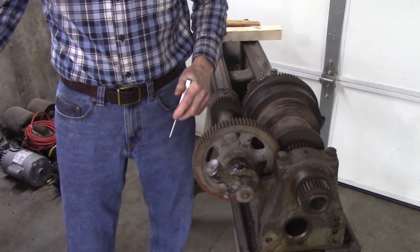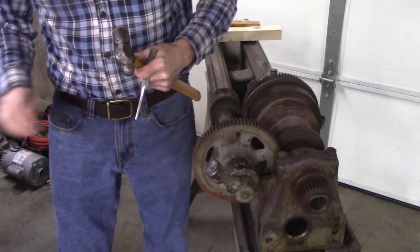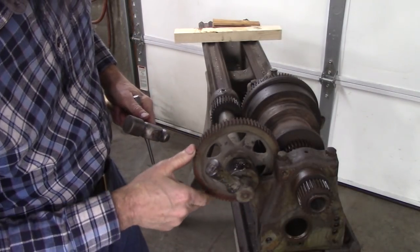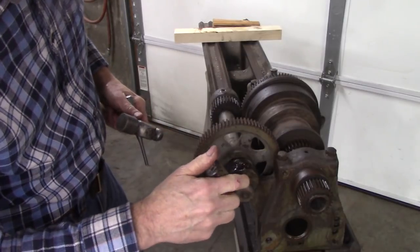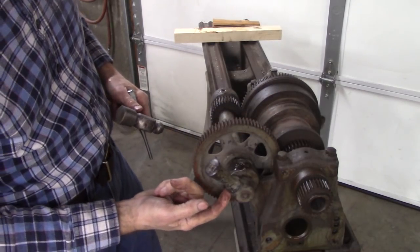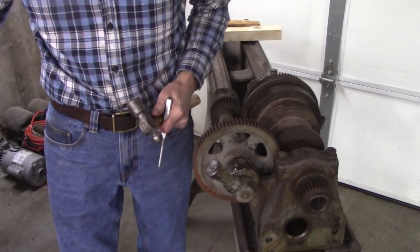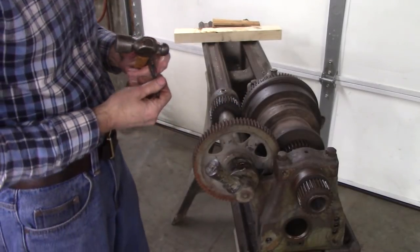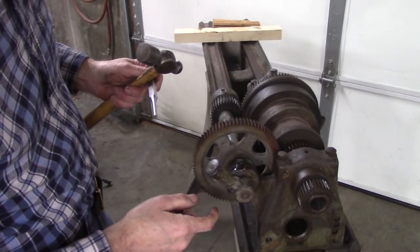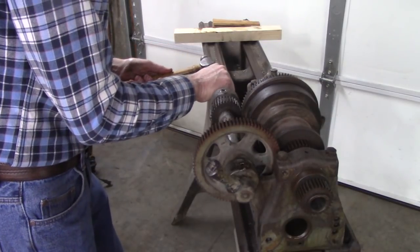Well, let's see if we can get this back gear out. There's a set screw right there that is an eccentric to adjust how far the gear mesh is right here, and that eccentric rotates to adjust that mesh. And there's a set screw here, got a point on it that falls into a hole on that eccentric to set that backlash. Some pretty precision machining going on there. I mean, the backlash is set one time, and anyway, see if we can get it out.